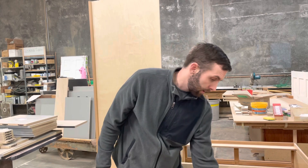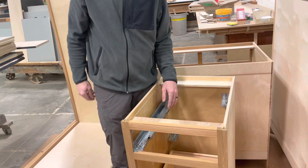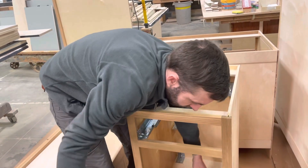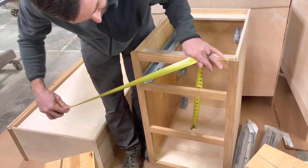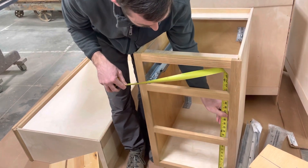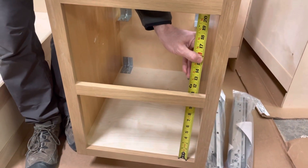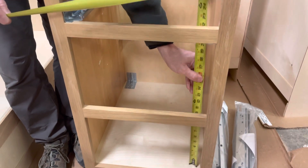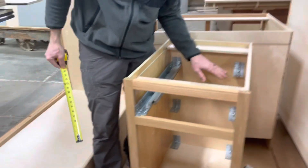So the standard: all rear mount brackets should be flush or a sixteenth lower. You're measuring that from the bottom across the front — yes — and that's what you want for your back too. I come in here, make sure my tape measure is straight up and down. Chris, zoom in — look at where the tape measure is. I'm not on the face frame, I'm on the plywood. There's roughly a 32nd of an inch lip there, and I'm looking at 22 and a half, so I want a 22 and a half inch spacer.